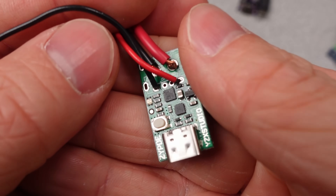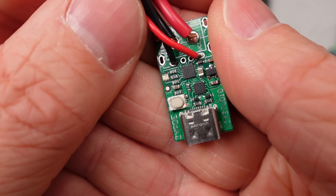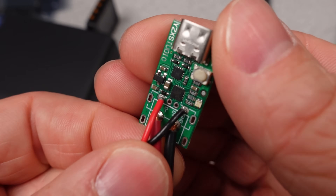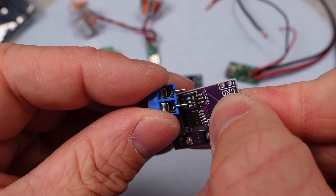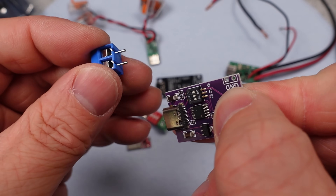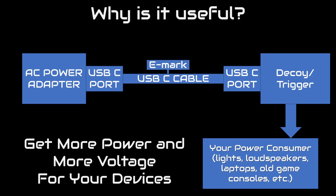In general, it is an off-the-shelf protocol chip that is used. These often have a few digital pins that will allow a microcontroller to pick a mode and adjust the requirements per device needs. In many cases now, you get DIP switches to force these modes or a microcontroller and a push button. These are useful for a lot of purposes — things like older laptops, game consoles, older computer power supplies, studio lighting, loudspeakers, really anything that needs a voltage range within the range of USB. With the current range of USB products out there now, this covers a huge range of small electronics.